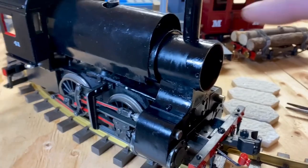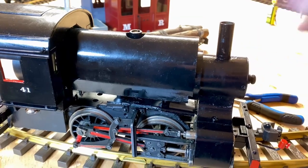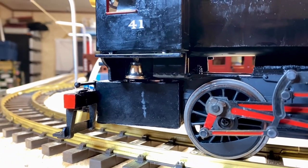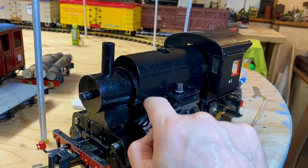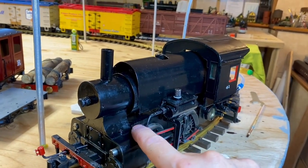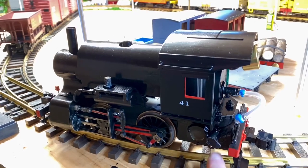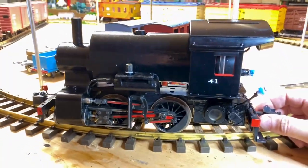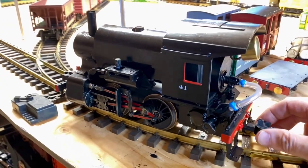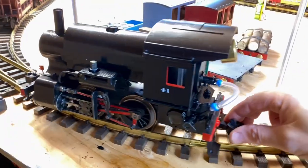This has an excellent cross-tube boiler — you can see it in there, all these cross tubes. What a great boiler, it really heats up fast. When this had the plastic bits on it, it had a bell; I've moved the bell and it now sits under the cab. On this side, this piece was soft but didn't burn. The step that was under here melted away; most of the fire was on the other side. The lubricator still remains in the same place, and here's the gas regulator — it's got a sight glass so I can gauge the amount of butane in the tank. Believe it or not, after this strange fire, I think I like it even more — it looks less like the original, it works better, and has better options now.